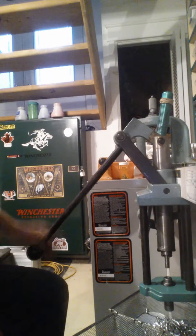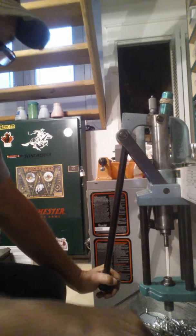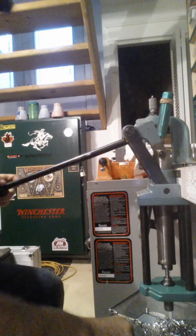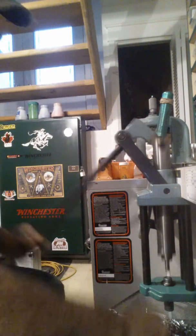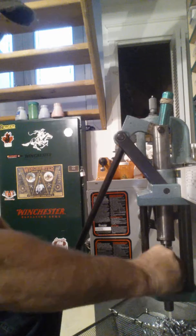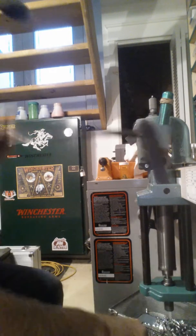For sizing your lead, bolt your press upside down on your bench. I have an old ammo press that works slick. Get your bullets in there upside down — I find this faster. Watch your fingers. It drops in there and works better than right side up. I saw this on YouTube a while back and decided to give it a try.